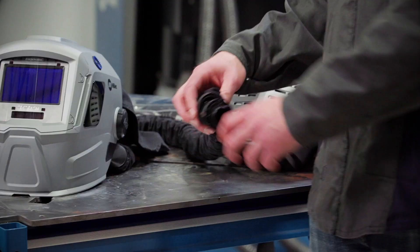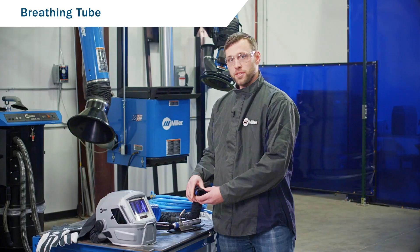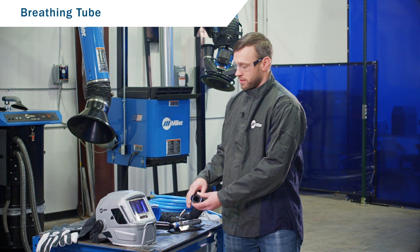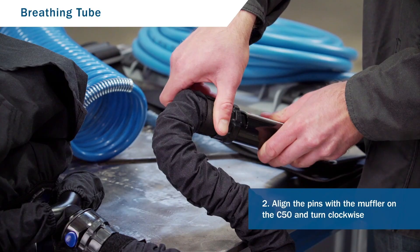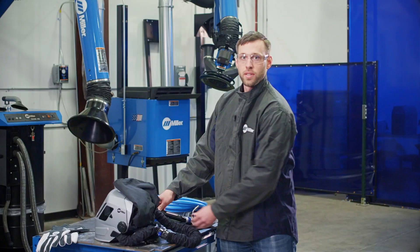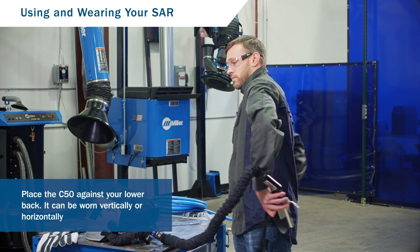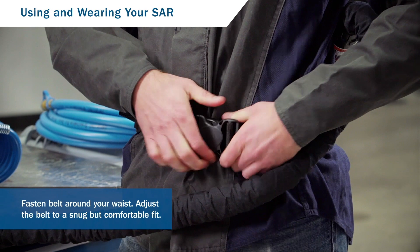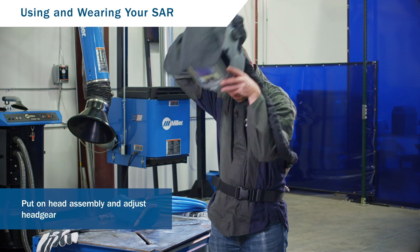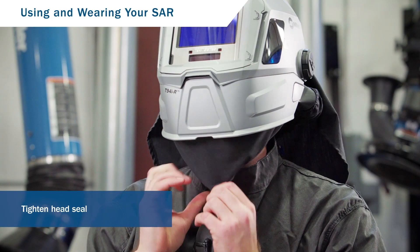Next, let's take a look at the breathing tube. Give it a good inspection and replace it if it's damaged or the inside of the tube is dirty. To connect, insert the end onto the head assembly, then on the other end, align the pins with the muffler on the C50 and turn clockwise to tighten. Check the belt assembly and make sure it's in good condition — if it's time to replace, you'll see noticeable holes, burns, or tears. Proper fit of your SAR system will maximize comfort for all day wear. Place the C50 against your lower back — it can be worn vertically or horizontally, depending upon what will be most comfortable for your welding position. Fasten the belt around your waist and adjust to a snug but comfortable fit. Put on the head assembly and adjust the headgear to fit snugly. Tighten the head seal drawstring to establish a tight seal around the neck. You're now ready to use your SAR.